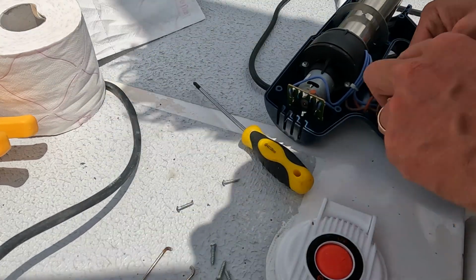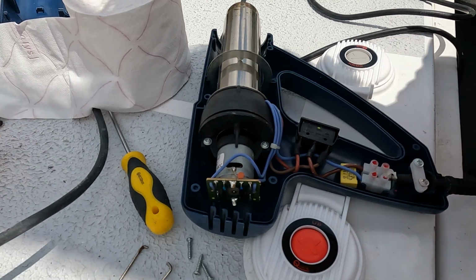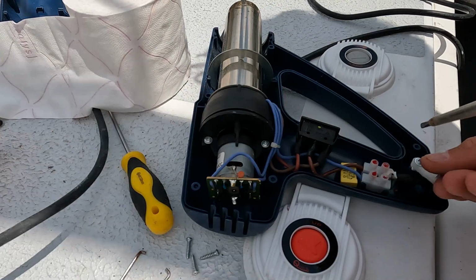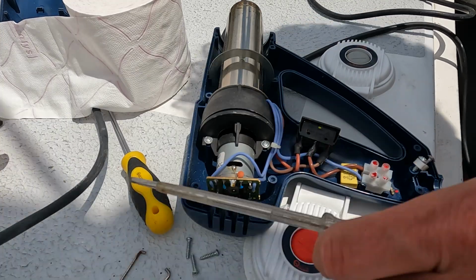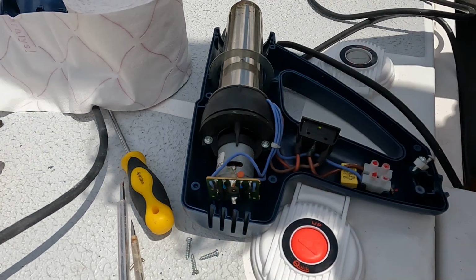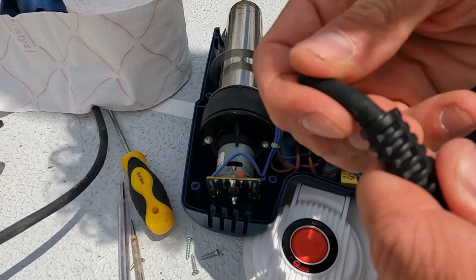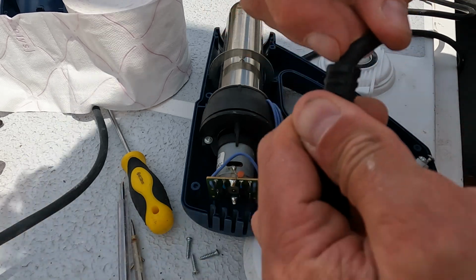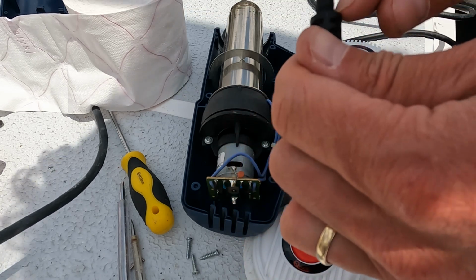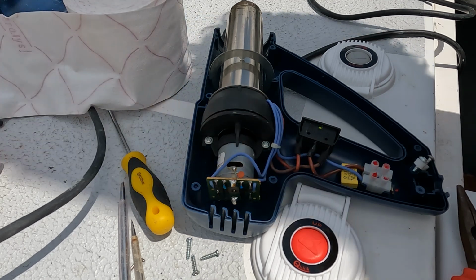That's all the screws out. Okay, green wire goes to blue. Light brown goes to dark brown. And it's a tiny little resistor that goes between the two. So I'm just going to chop the cable, rewire it. It's going to lose this thing to protect the chafe and protect the cable bending. But you see it's been bending right here. This rubber is really soft and the cable bends really easily there. So I think the copper is broken here. Oh yeah, this cable is toast.